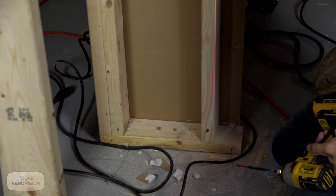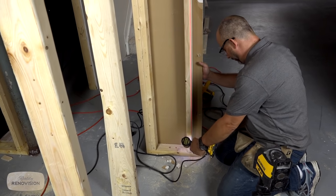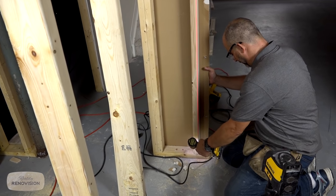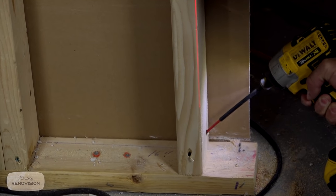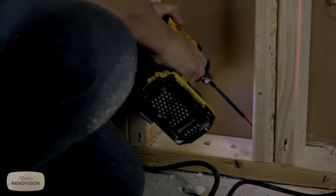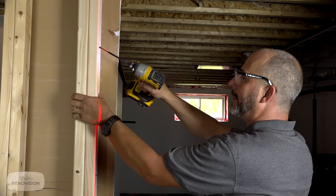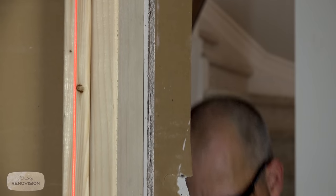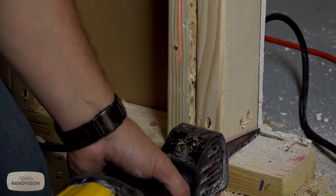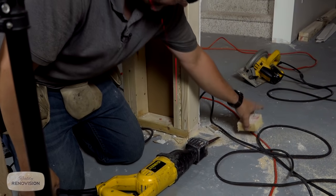And before I bury the head, make sure you're good here. You've got a bit of an overhang. Remember, when you're on an angle, it'll drive the wood forward. So I'm just going to drive forward, but I'm going to check here, make sure that gap closes. Put this one in. This plate has been fastened to the concrete with these nails here. Explosive hammer. So I'm just going to trim this back out of our way. Perfect.